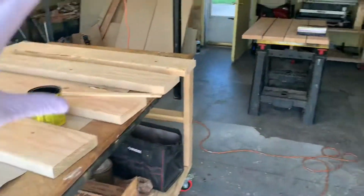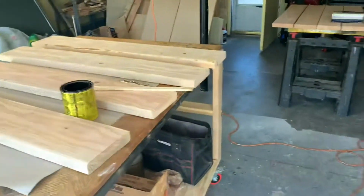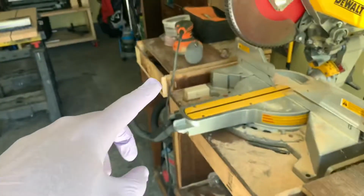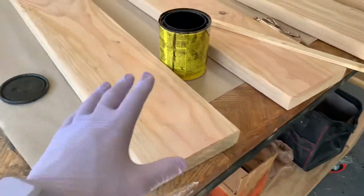So we made 8 different pieces of 45-inch 2x8s. They're all sanded now. I actually took my sander, used 60 grit first, and went over as much as I could to smooth everything out. I don't have a planer or a jointer, so obviously this step took a lot longer, but I used 60 grit because it really eats away, gets everything much smoother, faster. Everything nice and open, nice and smooth.